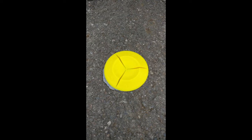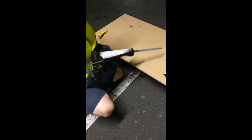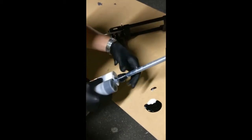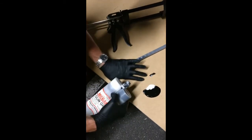You may have some glue squirt out but you can clean that up a little bit later. Continue to install Trolley Stopper until the job is finished or the epoxy has run out. It is better to work in teams of two if possible, as one person can glue the Trolley Stoppers and the other person can install them. If you still have some epoxy left, you may want to save this for later or another job. Simply remove the epoxy tube from the gun, remove the mixing tube and put the tabs back in place.